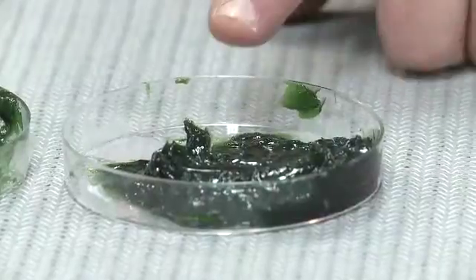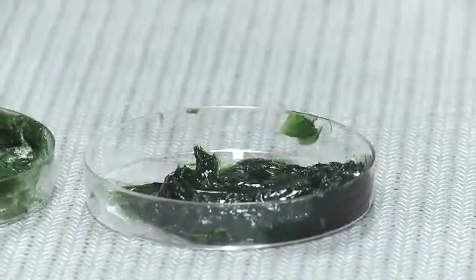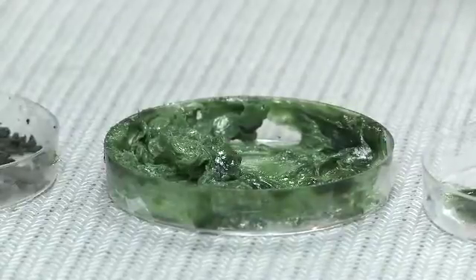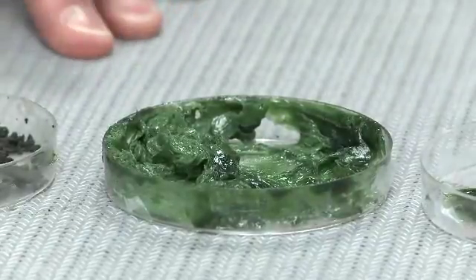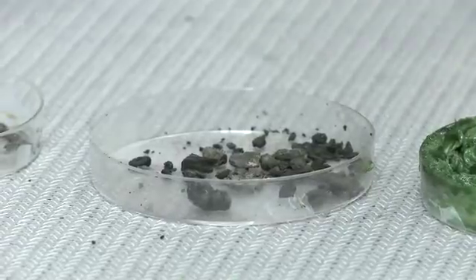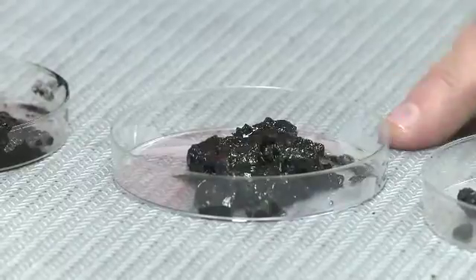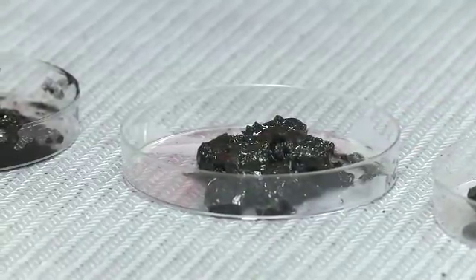Out in the field that could be a different scenario. Our first grease sample is fresh grease — looks the same, great grease. The second one is water contamination — looks a little pale, milky in color, and very thin in consistency. The next one is dried up — you can see it's pretty dry, doesn't look like grease at all, no oil left. After that is overheated grease — generally black in color, could even turn into carbon dust.